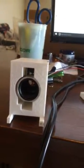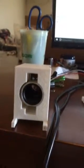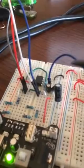This is my micro applications final project, and I'm Jonathan Schultz. In front of the camera is an infrared lens. It basically provides accuracy to the thermopile thermistor circuit sensor in the back, which is on the other side of that circuit board. These four wires lead to a breadboard that is externally powered by 5 volts.